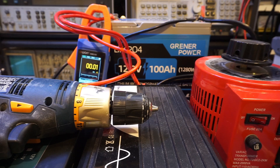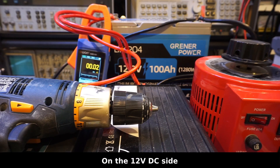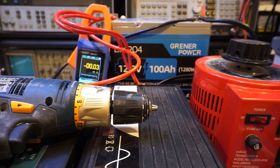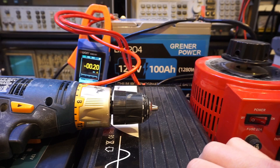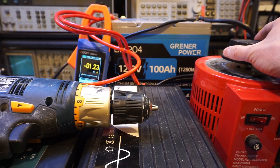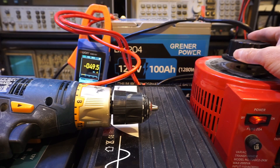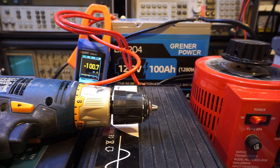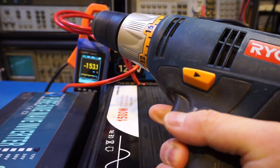For the next test I wanted to look at inrush current. The peak discharging current is rated at 200 amps for three seconds. I tested whether the battery could power the heater while simultaneously starting an electric drill. The drill's starting current is around 160 to 170 amps as measured in previous videos, so the combined current would be well above the rated 200-amp peak. However, the inrush duration is just a few tenths of a millisecond, so it should be fine. Starting the inverters, setting the variac to 100 amps — no problem at all.